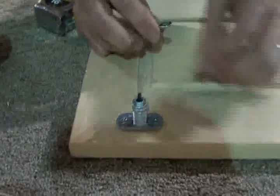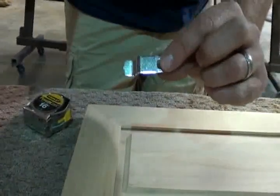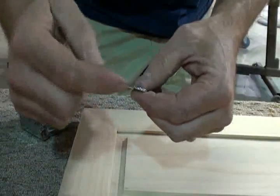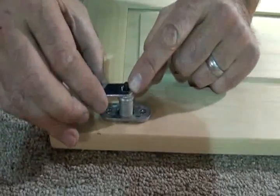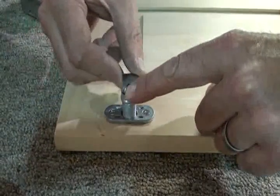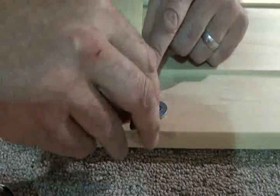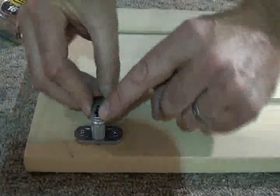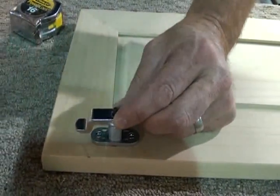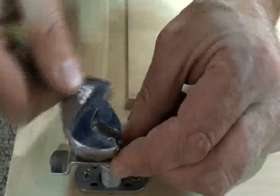So you've got it nice and tight. Okay, and now once you've got this secure in place, I believe on yours we used this particular plate. Your kit will come with one that's just flat. Look at your other doors, but I think it was this one here that we used. And the bend will probably bend down like this. Now it sits down onto the barrel on a square peg. You want to make sure that the action will turn into the door toward your hinges and up to the top of your door. If you put this in a different direction, the action will work, but it'll go the wrong direction. So bottom line is you want the action to go up and to the side. And once you've got that in, there's a little nut that it came with. Go ahead and put that nut down on there, and tighten that down.